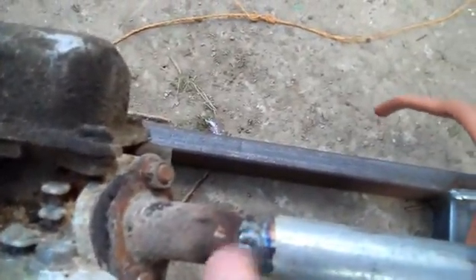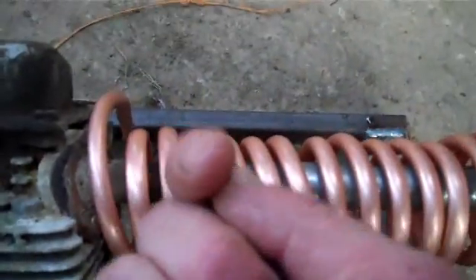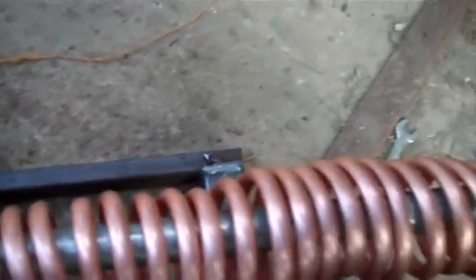Down here on the generator, we've taken off the exhaust and we've used the old mounting of the exhaust, cut off the exhaust here. We've put on a bar and the smoke is going to come through the bar to the end here, and I'm going to put a cover over this so the smoke comes back and out here, warming this heat exchanger as it goes and hopefully heating water.